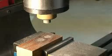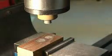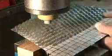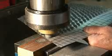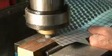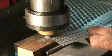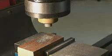After you're done with a row here, it's a good idea to brush that off so you continue to work with a nice flat surface. These particles build up under here. Now, really the hardest part about this is after you get near the end of a row, when the abrasive tool has to go off the edge, you really got to hold this thing a little bit steady here and use light pressure and slowly burnish it. Otherwise, it walks on you and spins out of there.